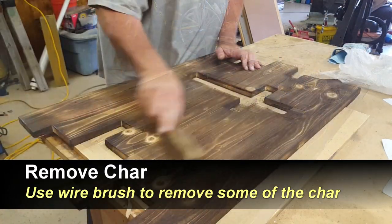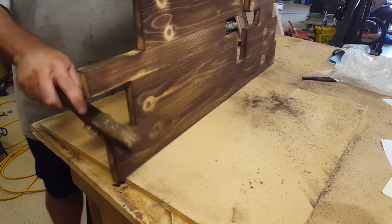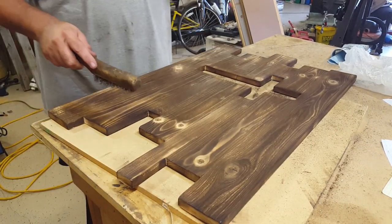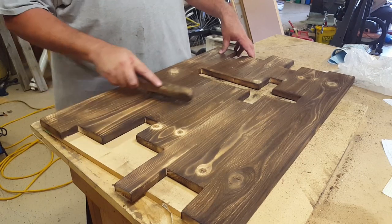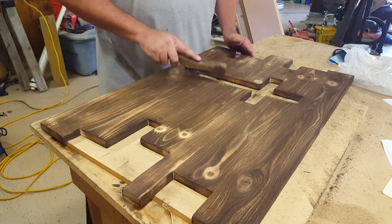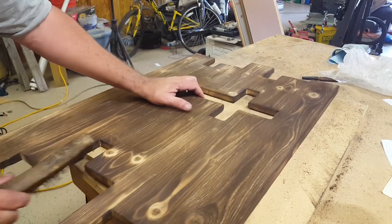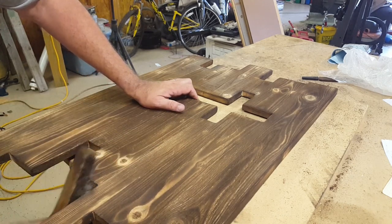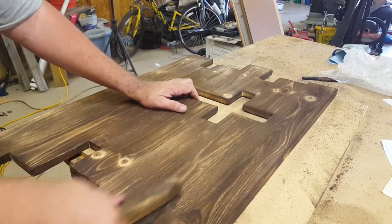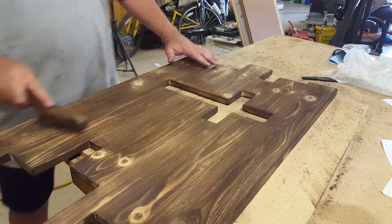Doesn't like a little bit of fire. Now I'm not going to do this several times. If you're actually trying to preserve it and make it kind of weathered, this is a technique, I guess, that I can't even say the name, Shou Sugi Ban or something. It's a technique for preserving the wood without it being treated with chemicals. You do it several times and brush it off, get a good brush and everything, but I'm really doing it because this is going to be stored inside on the wall, so it doesn't necessarily have to be weather resistant. I just like the look of it because of the dark charred areas,